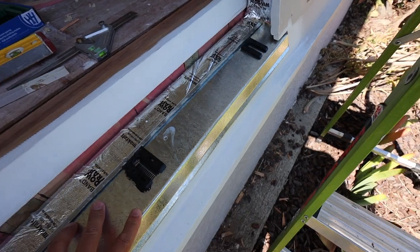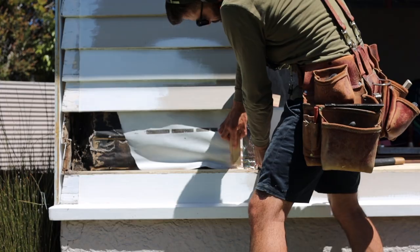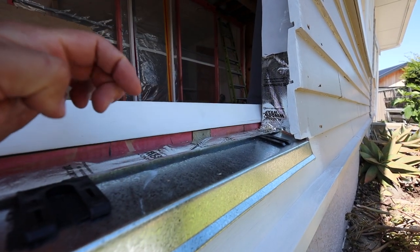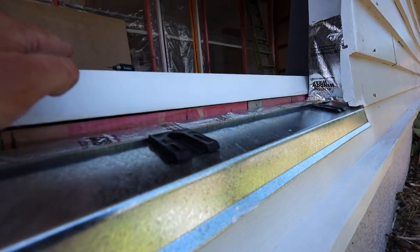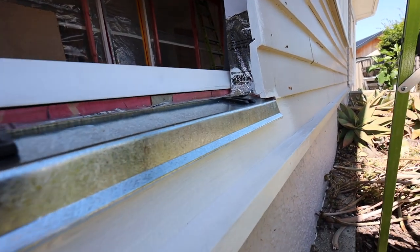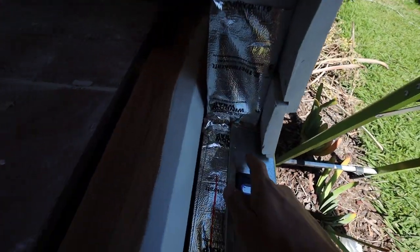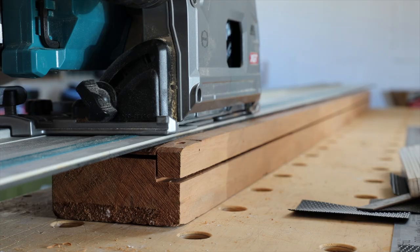Speaking of doing it right — this was a bit of an adventure, the sill. When you put in a new piece of timber joinery in New Zealand, you get a sloping piece of timber — that's what this is. You get some window wrap on it; that was a mission trying to get that in behind the weatherboards. I ended up taking these weatherboards out to get the window wrap on correctly. Then once the window wrap's on, you put the sill tray — it's got a bit of a kick at the back here, so if any water gets onto here it won't track back up, it'll just come out. Then you have your 5mm packers on top of that and your timber sill sits on there, with a separation between the timber sill and the flashing. An important detail a lot of people could easily overlook: the window is going to end here, but the sill tray continues. The window opening is 40mm bigger than the window, so if you ever have a leak between the framing and the window it can drop down, hit the sill tray, and go out.